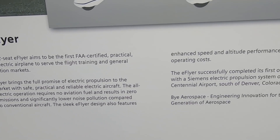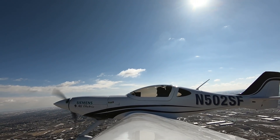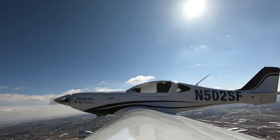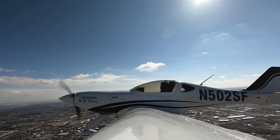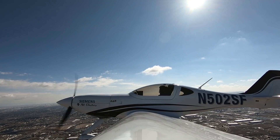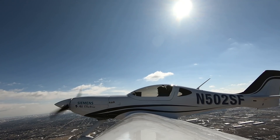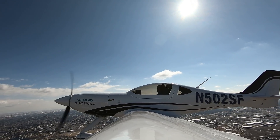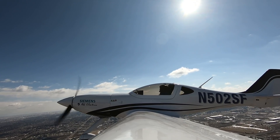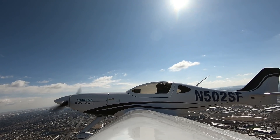As we've gone through this flight test phase the last three or four weeks, we're using a basic battery pack. While we're in the swap-out to the production Siemens motor, we're going to add an additional battery pack to get the voltage up and to look at longer endurance flight time with the next series of flight tests coming up later in April and May. We're using an LG Chem lithium ion battery at 260 watt hours per kilogram.